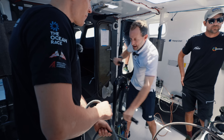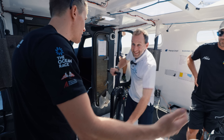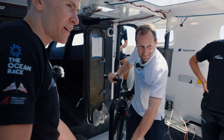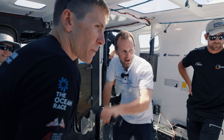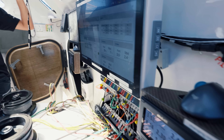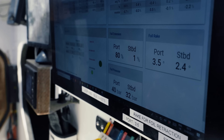It's weird because at times it's hard and then it goes easy again. That's the foil moving in and out of the water — we're only doing two knots at the moment, so imagine trying to do this when you're doing 15. Very hard. We check with the skipper: how much extension — 80 percent? It's at 79... and that's 80. So now I'm going to release this and lock it off.